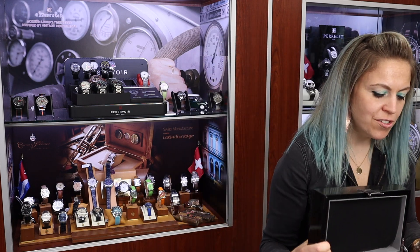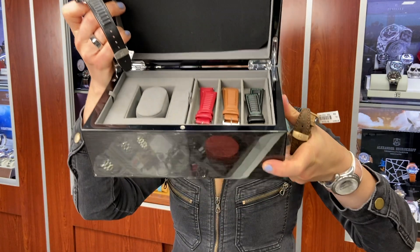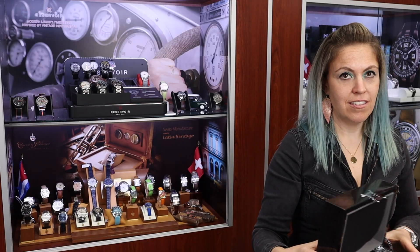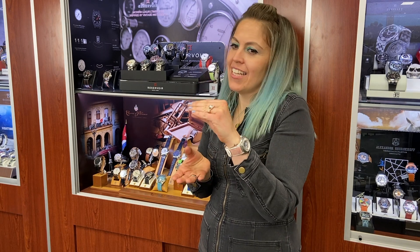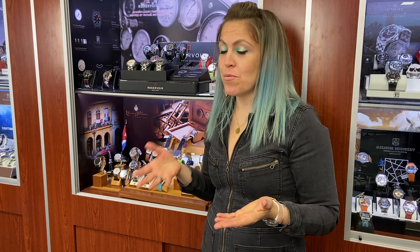The presentation is awesome. As I showed you on the Canister, it comes with three different straps; otherwise there'll be a NATO strap in there. The watch is powered by an ETA base, which means it's easily serviceable. Should there be power reserve issues or anything like that, the watch can easily be serviced because it's based on a 2824 movement. A high-end movement maker created a module that holds the drum, the power reserve, and the retrograde minutes on top. Should there be any movement issues, you can literally just replace the module — take that off and put a new one on. Servicing down the road is very easy, and they wanted to make ownership as painless as possible.